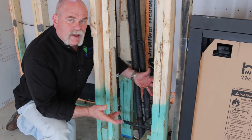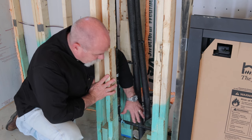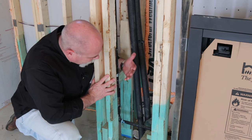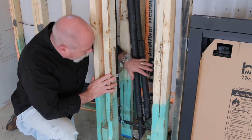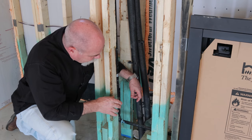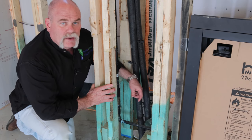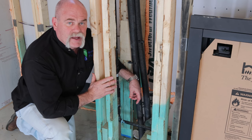Being part of a Dallas plumbing company, I've done a lot of plumbing work in Dallas. Here's what I like — the black steel pipe for gas. I love that; that's old school. And remember, this is a two-story house, so even though the drain went up over there, your water lines to catch upstairs actually come up over here. What they've done is looped the PEX line under the slab, come up through a PVC sleeve. Now you've got two water lines here that'll run upstairs and go across to help catch some of the bathroom plumbing upstairs.